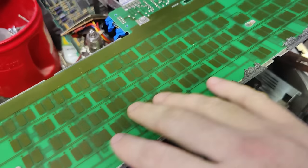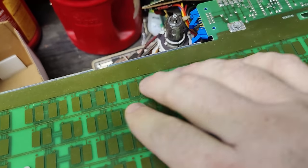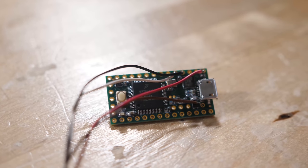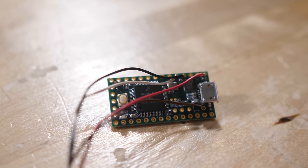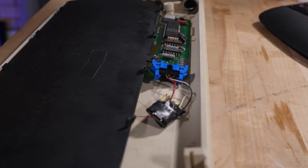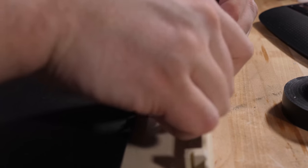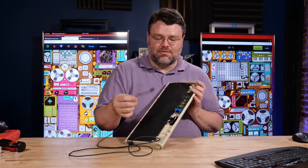This controller is pretty trustworthy electronically. The downside is that it still draws a fair amount of power, but USB can pass quite a bit of power. These are Teensies — technically they're only rated for about 150 milliamps, but they actually do a pretty good job as long as the USB ports on your host computer support it. It is a micro connector instead of a full-size connector; I'd prefer a breakout board with a full-size connector, but it isn't bad. You can pick up a braided reinforced cable from various third-party sellers.